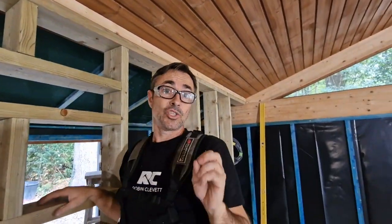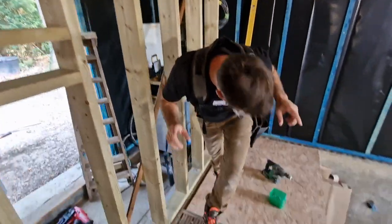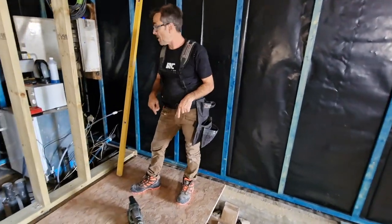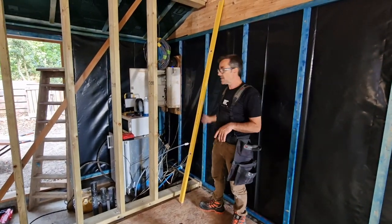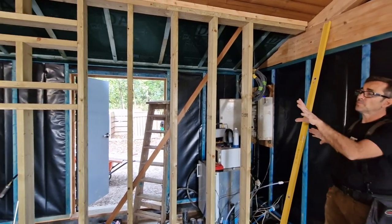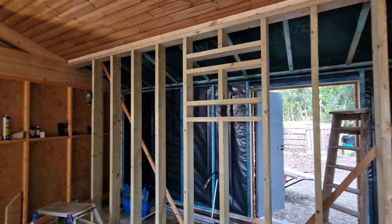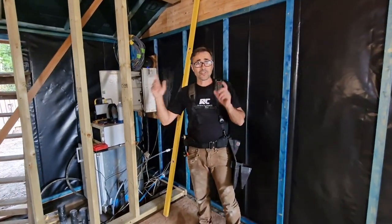And that is the job finished. The wall's finished. We're standing on the last four joists, which is our temporary support, and these joists will whip out and they'll go in there. But before I put this in, I'll probably put it in loose, I'd want to clad that wall through there. Before I do that, I need to run some electrics. So for now, this will be as far as we go with this wall. We'll probably just temporarily put those other studs in, out of the way, and run some noggins straight down the middle.